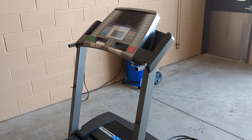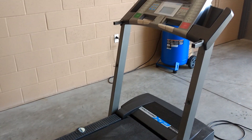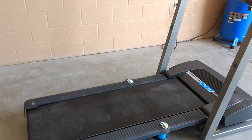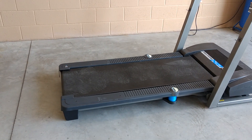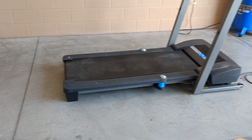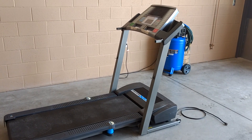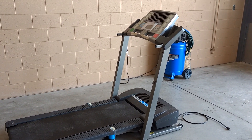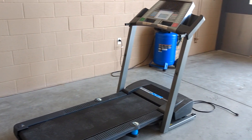Many people have asked me why I chose a treadmill to build this project. The main reason is because of the components that a treadmill comes with. Treadmills are powered by a DC variable speed motor, and one of the benefits of that is you get full torque at low speed. This is perfect for building a slow speed cement mixer.